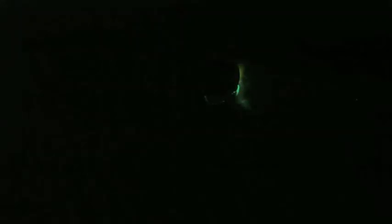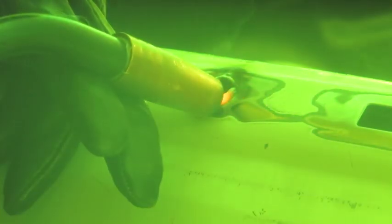So there I built up the perimeter with some weld. That way it'll be a little bit easier to go around it. Hopefully there'll be some strength greater than the thin gauge that's here, so let's see how that works out. Well, so far so good. I'm able to make at least one half of a revolution. Let's see if I can finish off the rest here. I can see when I'm burning through, I can see when it's getting too hot. When I do that, I just ease off of the trigger and squirt a few tack-type welds in there.